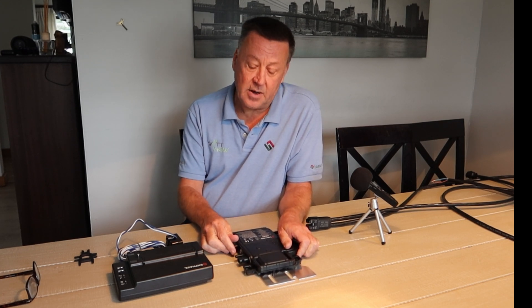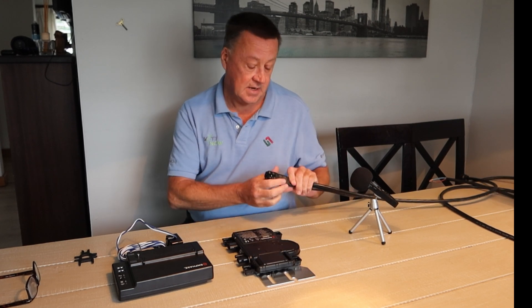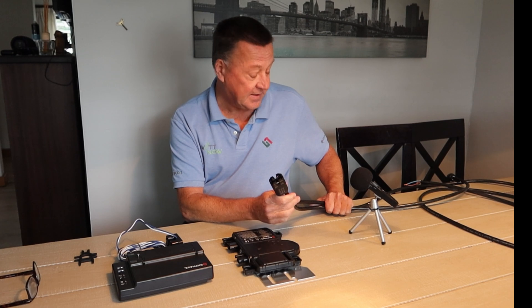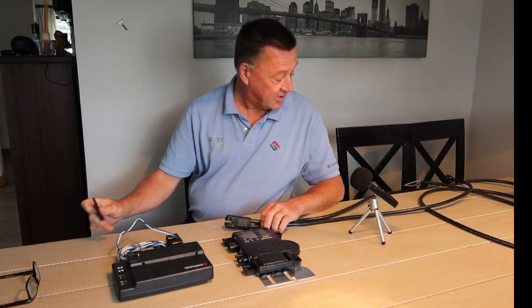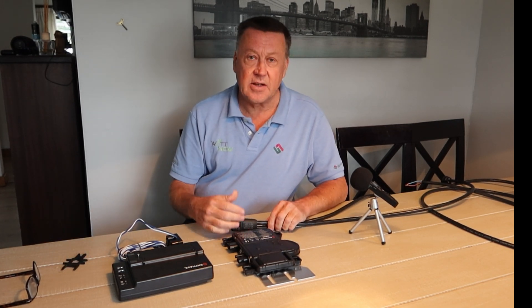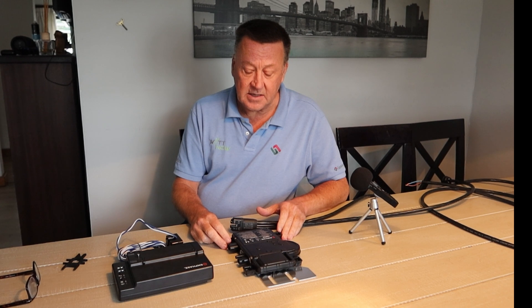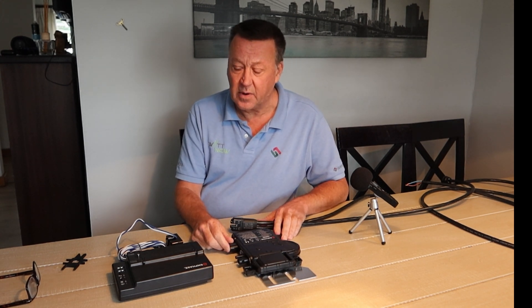We're able to go from there directly onto an AC connection using the Q-series cabling — pretty hefty, high-quality cabling. It's expensive, but really, really good quality stuff. If you are going to purchase their equipment, make sure you get the tool, because you won't get this out without the tool without damaging it. Those cables are able to link directly into sub-DB boards and cut down on the cost of electrical wiring. And obviously, there are no DC combiners, fuses, or any of that other stuff.